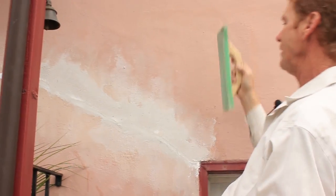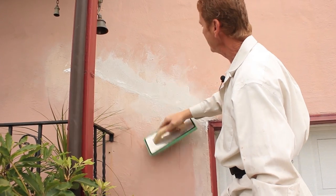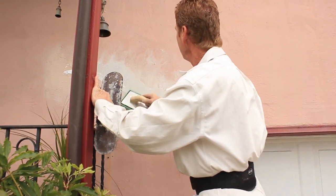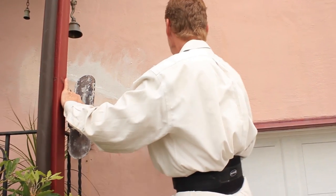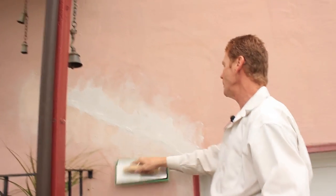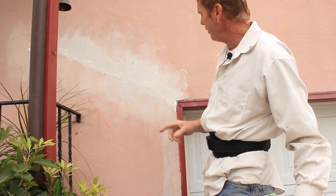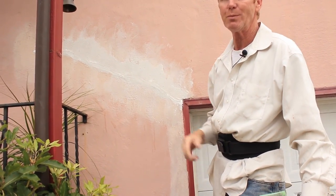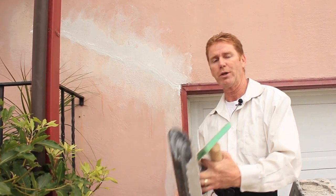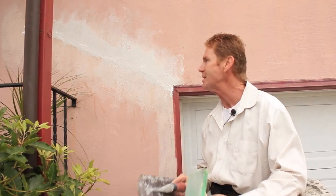The reason I put sand in it is because this stucco wall has sand in it, and the reason I use Sikaflex is because it is the best caulking I know. If any of you have comparables, send them to me — I know there's Rain Buster and quite a few others, but this stuff really works well and saves me a lot of time. Anyway guys, my name is Kirk with Kirk Giordano Plastering. Thanks for watching — I'll see you on the next one.